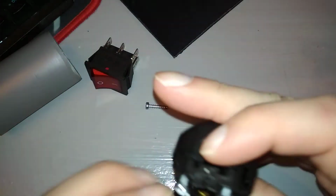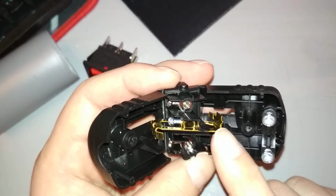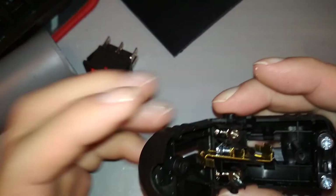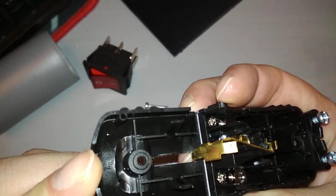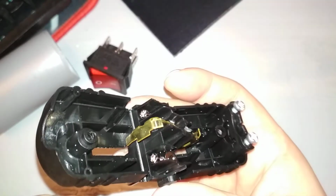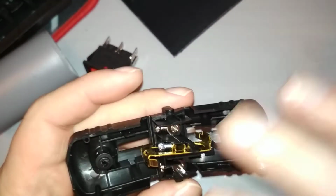And why this half doesn't want to? Oh, it's like this. Yeah. So inside I only need the 2 pins. The grounding is handled separately. I have a wire leading up to the washing machine for grounding. Yeah. Oh, I have to bend it back because I can't access the screws. This has to be bent back quite a lot. So yeah, that will break off if I try to replace the wire a few times. That's not very good, but yeah, it was cheap and appropriate for 16 amps. Not a problem yet. So yeah, I need the 2 wires.